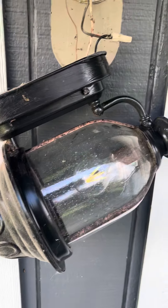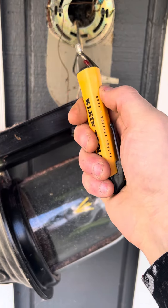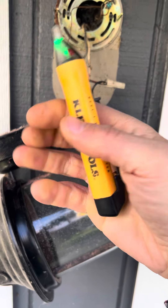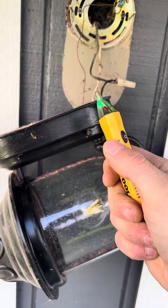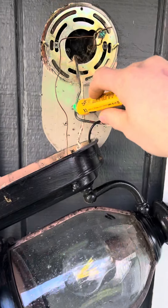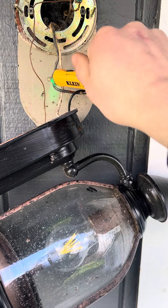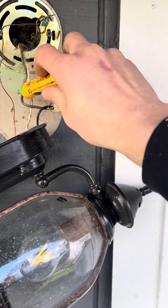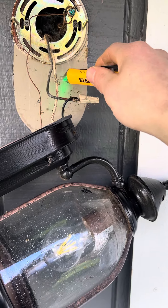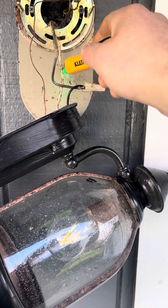What I'm gonna do — I've got this handy dandy little tester. It may not be the best one, it's from Klein. It's gonna start beeping a lot and flashing if this is hot, which it is not. You always want to go for that black wire because that's gonna be your hot one, at least on 120-volt residential service. Try to focus on that — don't touch the ground or the neutral, just focus on the black.